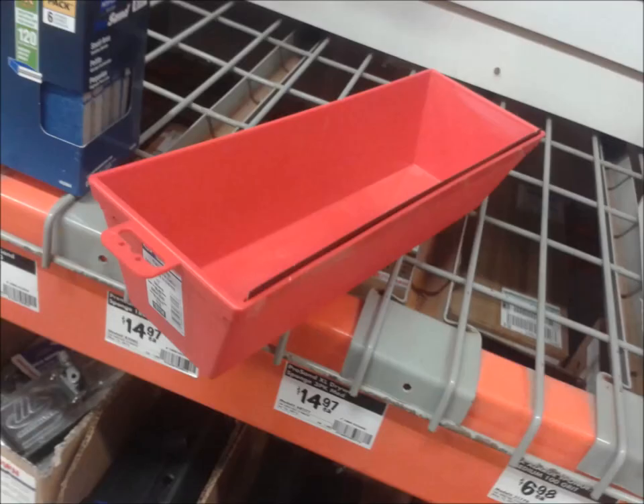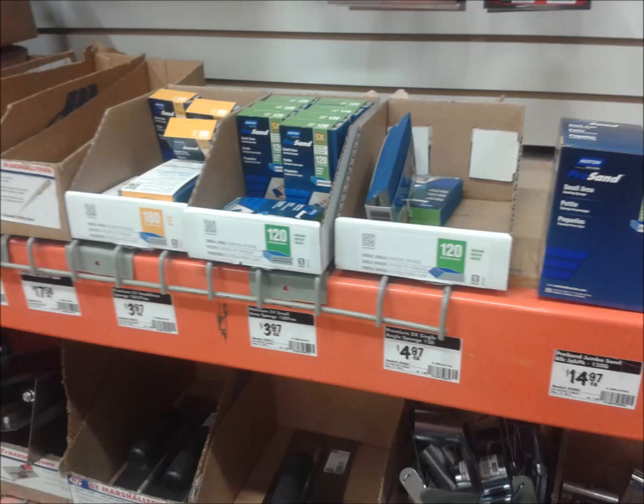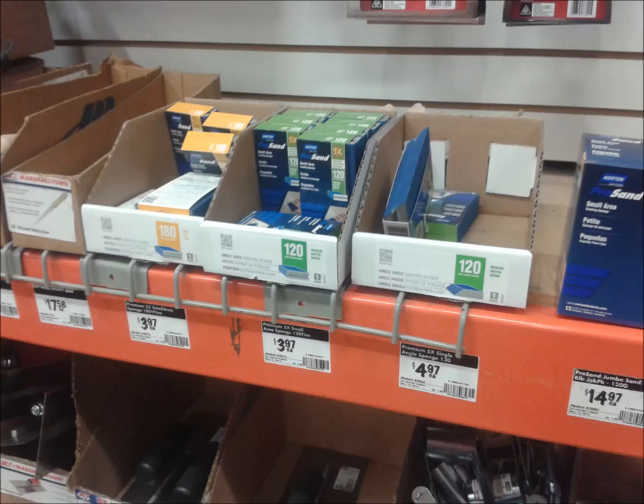Here's a pan — just a pan. Very good for mixing small batches of mud for patching and other things. It's a good water ladle too. Sanding blocks, sanding sponges — same thing, just different grits. 180 grit is too fine; buy the 120 ones. 180 grit is more for the do-it-yourselfer who's worried about over-sanding their work — just be careful and buy the 120.